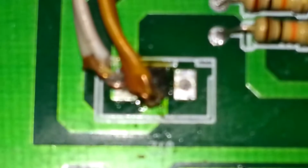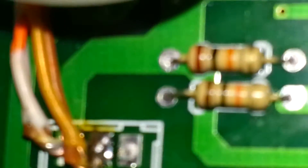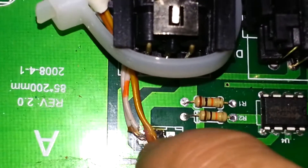You can see where there's two wires — the orange stripe and the brown stripe, and then the brown solid and the orange solid. There's two wires there together and I soldered them together to the pad. Just know that I split this — I actually have two wires connected to the middle solder pad and two wires connected to the left solder pad.